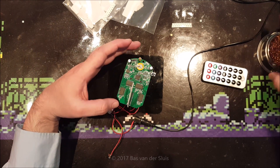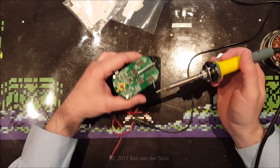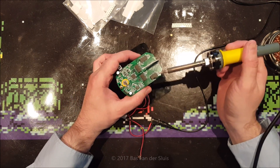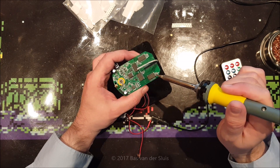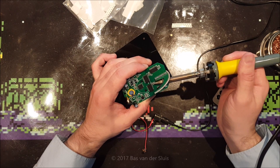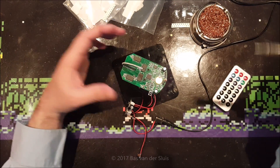The hardest thing I'll have to do is remove the 1.5 kilo-ohm resistors and replace them with the 4.7 kilo-ohm. What I'm going to try is put my soldering iron to both pads at the same time and push it aside. I'm going to start with the most accessible one first - the others are a little bit harder but I'm going to try it.